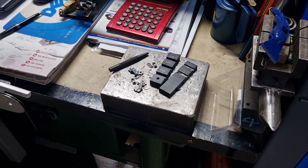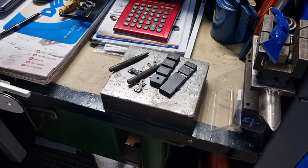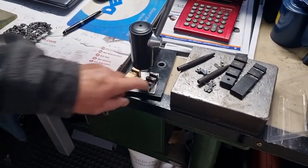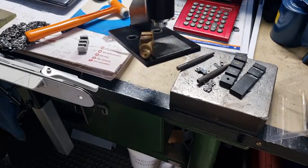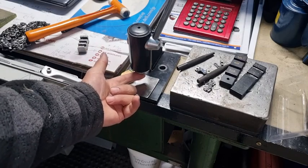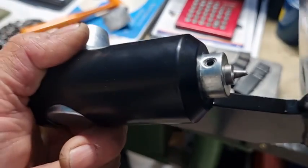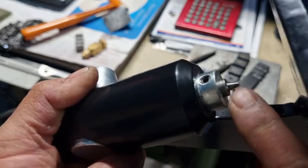That kit was $28, and for an extra $50 — around $80 — you can get yourself an Oregon-type breaker that comes with an adjustable vice, which is much better. You're much better off using something like this. It's much safer — you don't have to smash the rivets with your hand. It has a hardened pin in there — it's a little bit difficult to see, but this pin goes in about another one inch and is held in through a grub screw. It's a very hard pin.